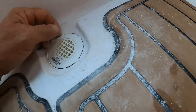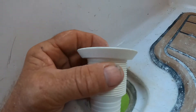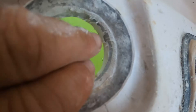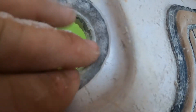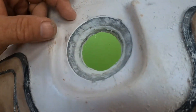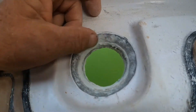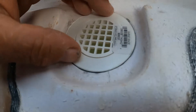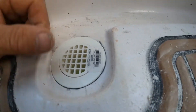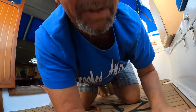Alright, I've got that beveled. I've also got the gap — you can see the 5200, the white line right there. I've got that void filled with 5200 and let it cure. So I'm going to take a sanding block and sand this a little smoother, a little rounder. It's got my drain sitting flush. I'll get that done and get started on the starboard side — let me cut that one out and I'll show you how I get it out.